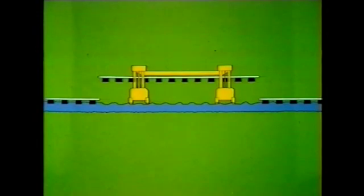Now for the relaying cycle. This is the old track which has been recently re-ballasted — it must now be relayed. The first job is for the single line gantries with the loose sleeper beam attached to lift out the old track from behind the train and deposit it onto the empty wagons. This leaves the ballast uneven. When sufficient old track has been removed, the grader sets to work to level the top surface. It is not good enough to level this surface manually — a high quality grading machine is essential at this stage to achieve a good and lasting top in the finished track.